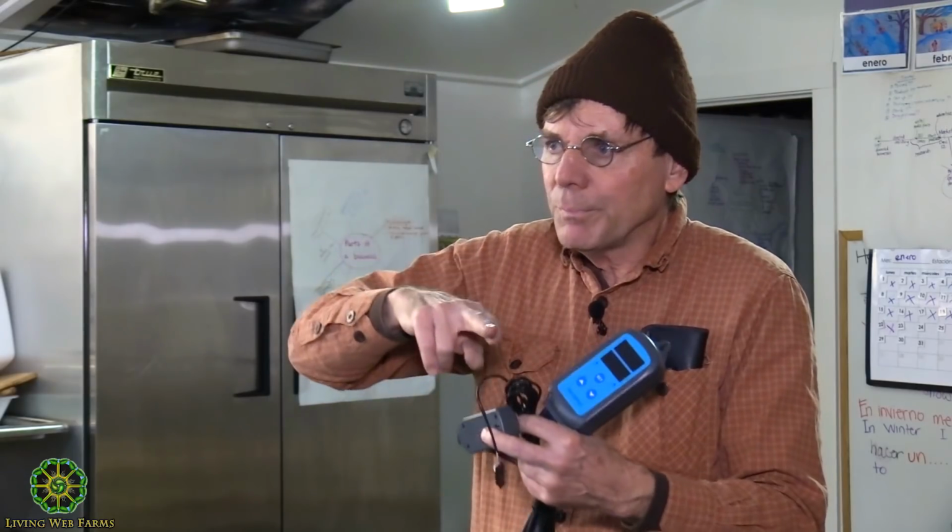So that's the plug-and-play version. I think it's about $29 for that one. You turn it on, then set the level you want and when you want it off. There's a built-in hysteresis, which means you don't want it to cycle on and off constantly. When it reaches the point to shut off, and then drops just a little bit in humidity, you don't want it to start right back up, because that puts too much pressure on the humidifier. So there's a little space between when you tell it to shut off and when it gets told to turn back on after a while, so it's not cycling back and forth.